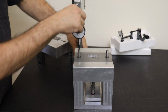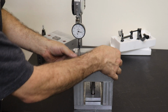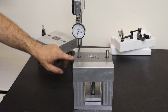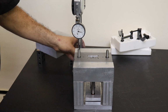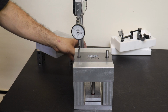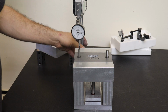Then if we look at our stripper plate, which doesn't have the springs installed yet, so it's not compression seated. In fact, I should probably look at clearing out the inside of it. But at the moment, yeah, it's way off. So I believe I need to actually seat this plate correctly and make sure there's no particles underneath it, and then remeasure.